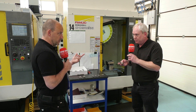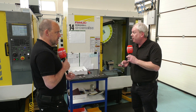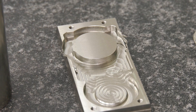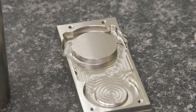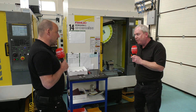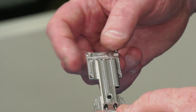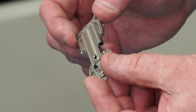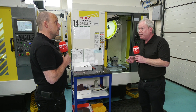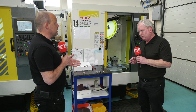The speed and dynamic nature of these machines makes that a very smooth cutting operation, doesn't it? Absolutely, yeah. So basically you're taking that bar, machining off the top and then off the bottom, and then the trochoidal milling comes into play in that operation — that's correct. If you look at the whole production time from bar through to finished part, roughly what would it be? We'll go for 40 minutes, all the way through from start to finish.